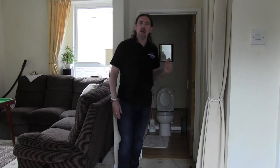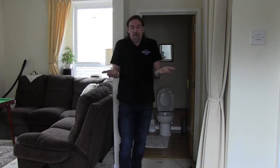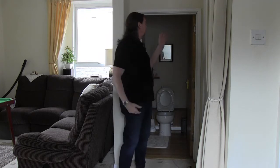I thought I could put a water tank in that cupboard, because if you're going to use rainwater for the toilet, you need a large tank to store the water collected from the roof. That tank has to sit higher than your toilet so the water can flow by gravity from the tank into your cistern. The obvious place was the toilet on the middle level, fitting the tank just above it and then finding a drain pipe I could connect to outside.